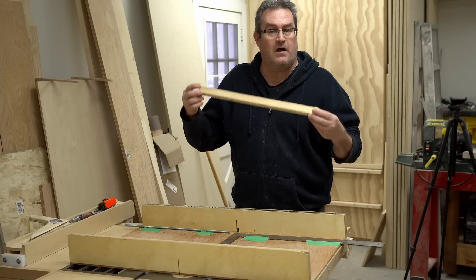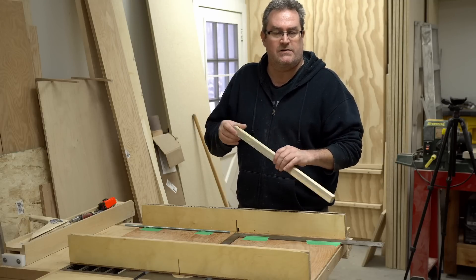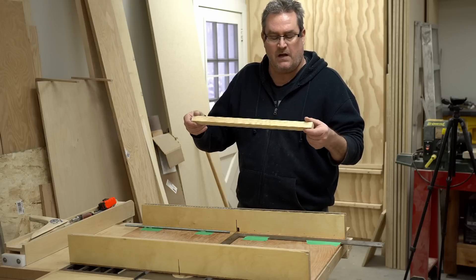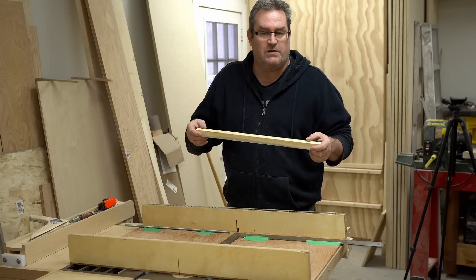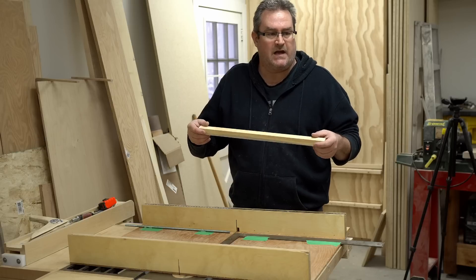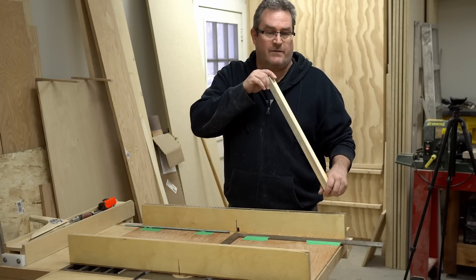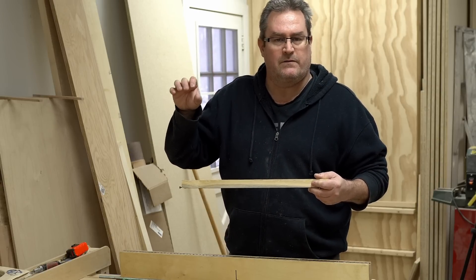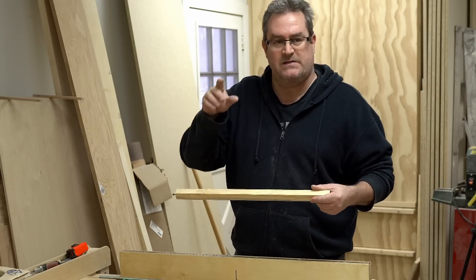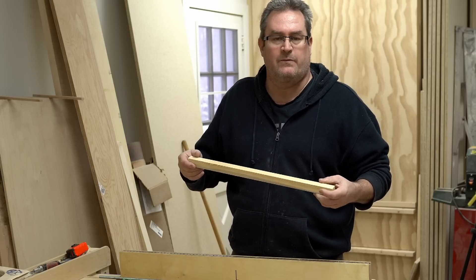You're also going to need a hardwood blank to cut the part from. I'm using softwood here just because this is a demonstration, but I recommend using the hardest, densest wood you can find. In my case I would probably use maple if I were going to use this for a jig. I would avoid something with a really open grain like oak because the individual slots can chip off a little bit more easily.